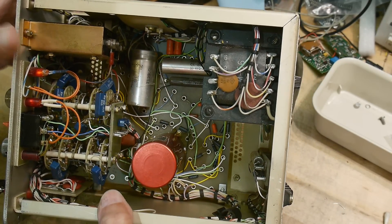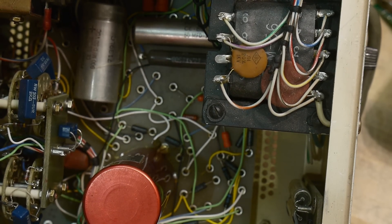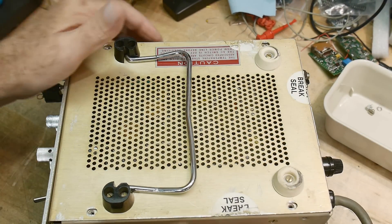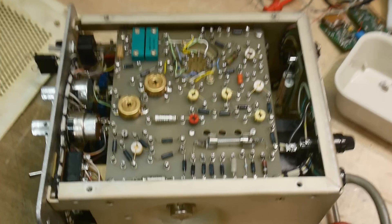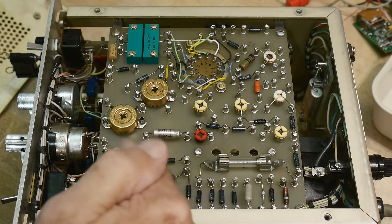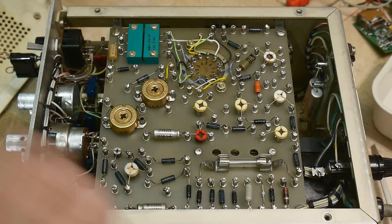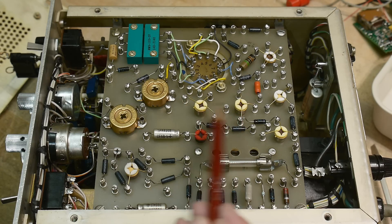Down in there, there is no PC board — well, there is a board, but there are no printed circuits. It's a circuit board with no printed circuits; there are all these grommets, and that's all it is — a bunch of grommets. We need to open up the other side. There's the circuit, and if you notice, there's no PC board — everything is point-to-point wiring. There's this board with all of these grommets, kind of grommets slash standoffs that you can wire things to. The grommets have been put in a particular pattern to make it their very own. We can see some transistors here — they're dead bug, they're upside down.